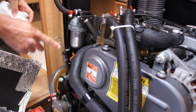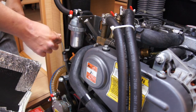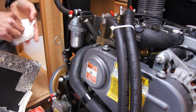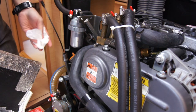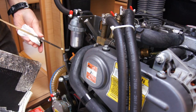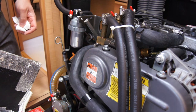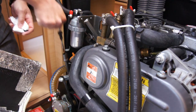To check the oil on the engine on Phoenix, the dipstick is really easy to access on the forward side. Get a bit of tissue, get your dipstick, lift it out right to the end, and give it a good wipe down. Dip it back in, leave it for a couple of seconds, let it settle, and re-read it.